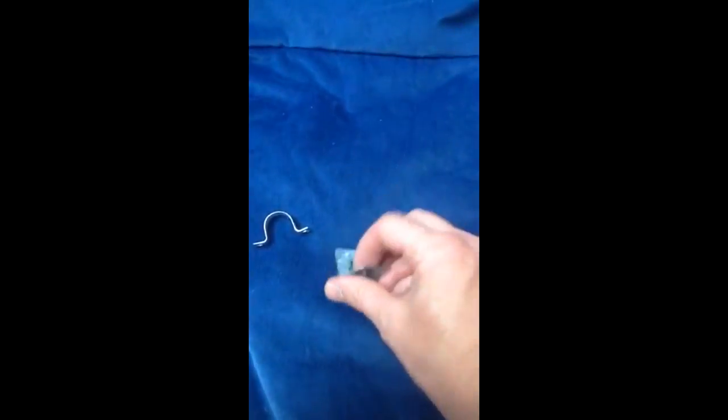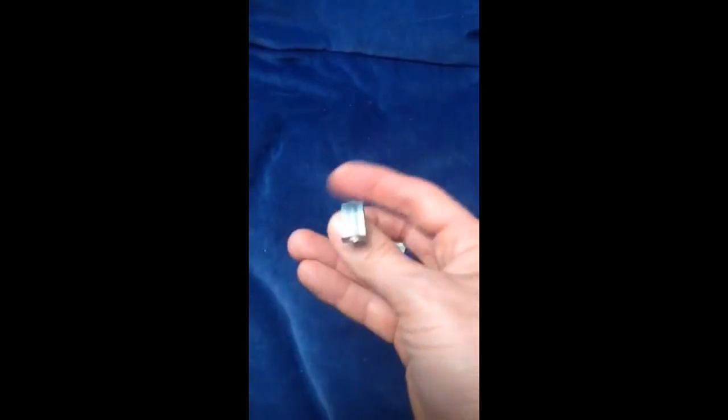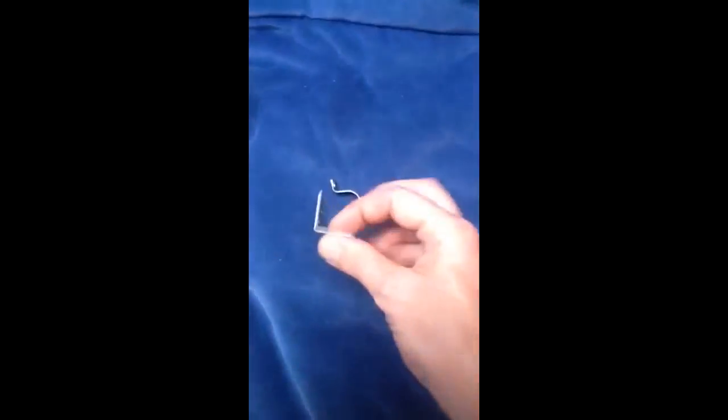This will be the anchor point — the base of the pole will rest on the wall so it doesn't slip down. I have these plumber's brackets lying around for mounting pipes on walls. Because the bottom of the pole is plastic, I'll just screw up into it to fix it to the plate on this L-shaped bracket. So if you have an old extendable mop handle or paint roller handle lying around, that's your pole. We'll now get on and show you what the whole setup looks like as installed by me, who has never done this before.